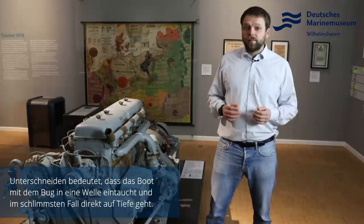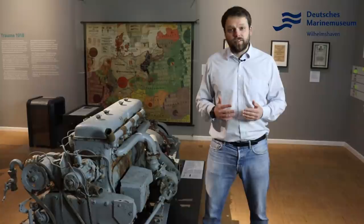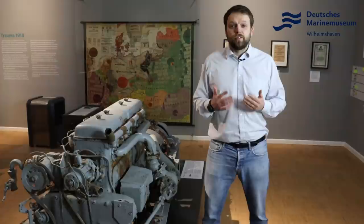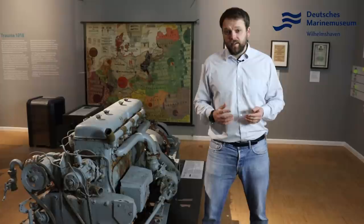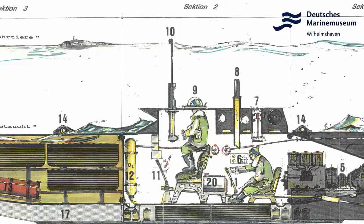As with the larger boats, the propulsion technology was not without problems in the Seehund either. When the propulsion valve was closed, there was underpressure inside the boat, because the diesel sucked air directly from the interior. Compared to larger boats, the Seehund was so small that the health damage effects — which also appeared over the long term on larger boats — were much faster. Lung damage could result, while problems in the fuel system could lead to carbon monoxide exposure. The leading engineer was practically seated with his back against the diesel engine.